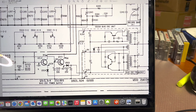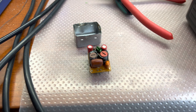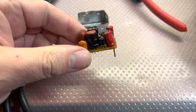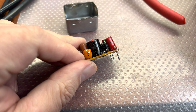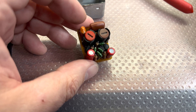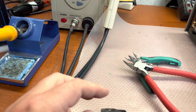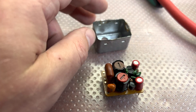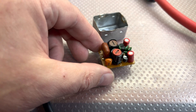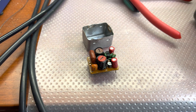That's the only thing I can do for this deck — everything else looks to be fine. After a while I opened the module, and you can see the famous orange capacitor and two electrolytic capacitors. This batch of small ones — I had to use two soldering irons to melt the solder and remove them because the board acts as a large heat sink. Let's replace these and see if it starts performing well.